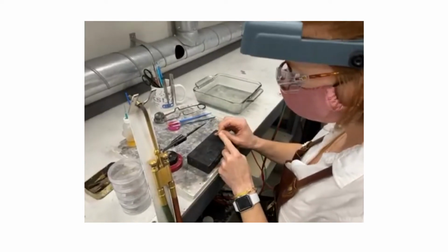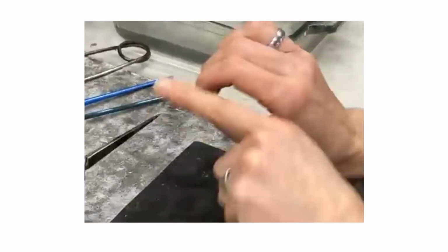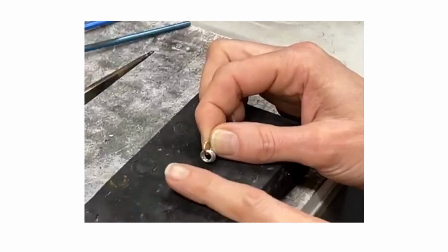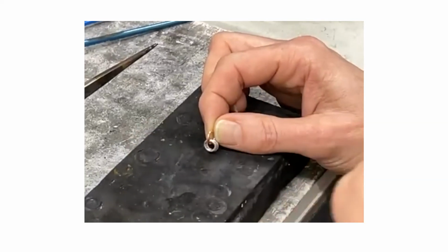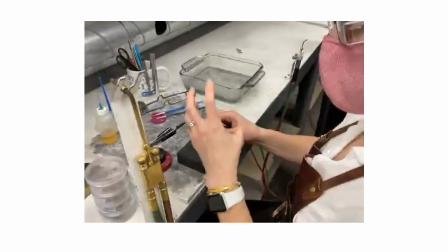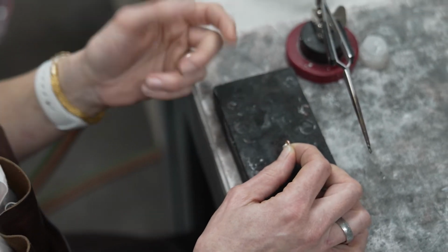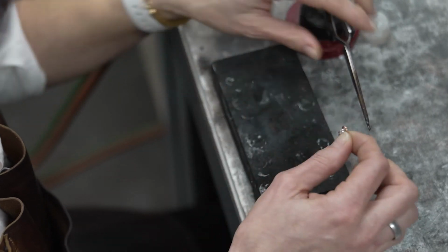This jump ring, which you probably can't even see on camera, has a seam right here, and it is light tight. You can't see any light through that. There's no space. Soldering is a process where we actually melt an alloy and it flows into the crystalline structure of the material itself. So we have expansion under heat, and this material melts and wicks through capillary action into that expanded crystalline structure. It takes a fair amount of control to get this to happen.